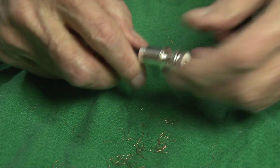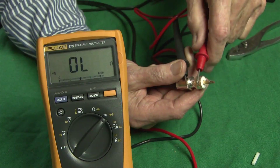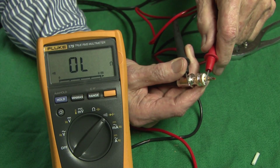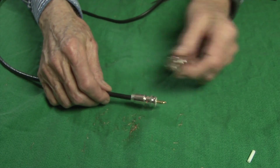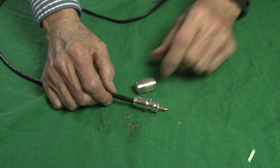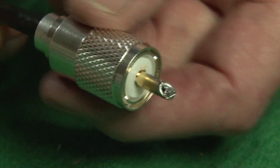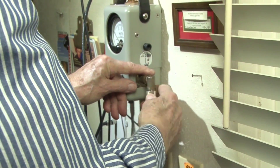Next, check to see if it can be wiggled or twisted — it should be tight and stable. Check with a VOM for continuity and then solder the center conductor. Don't forget to put the connector band facing the right direction on the coax before you start. Your connector will be stable and tight for years to come, no matter whether it's connecting your rig to the amp or the amp to your dipole.